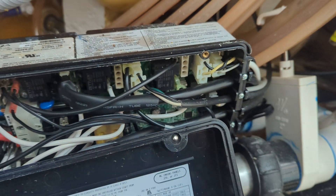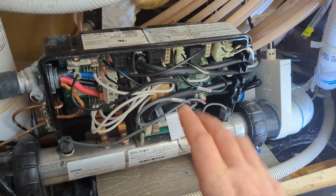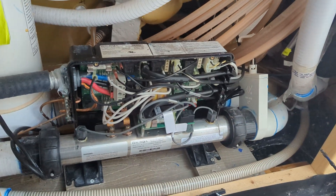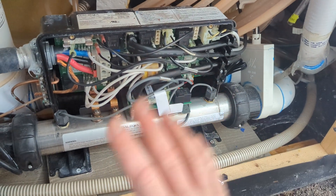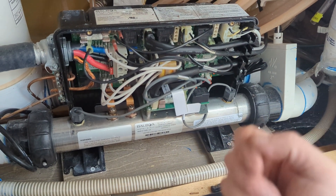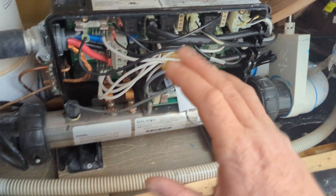We're going to try the ozonator. It's very, very important that you follow these instructions — there are other videos on YouTube giving you false information. Some videos suggest to unplug everything, put the power on, and then start plugging stuff in. You do not do that at all. Right now the power is off and you do one at a time. If you unplug everything and turn the power on, then start plugging stuff in, you're just creating an arc. You just don't do that.